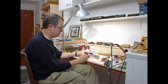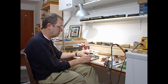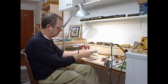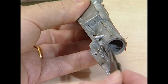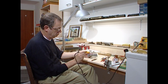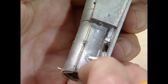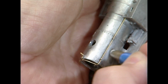Whatever adhesive you use, whether it's cyano glue or epoxy resin or polyester resin, all of those react nastily with heat. Certainly cyano does. You don't want to get super glue anywhere near heat. So what I'm going to do is solder the top end first of this from the inside with low melt solder. I hope you can see it's just protruding through. Plenty of flux. And that's come through beautifully. Clear off any excess solder.